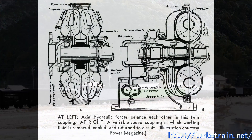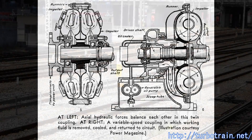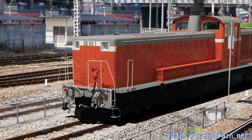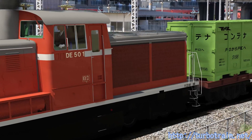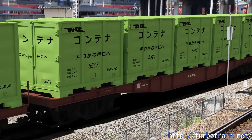Fluid couplings are simple and lightweight in structure, and can be turned on and off as well as adjusted for braking force by moving oil in and out of the converter. The oil cooling system for hydraulic converters can be used, and since it is compact and lightweight, it can be installed according to the required performance without much concern for weight. Brakes with fluid couplings have long been used in heavy-duty trucks, and there was little concern about the adoption of a new technology. DW7 is equipped with a fluid coupling that has an absorption capacity of 1440 horsepower, which is equivalent to the driving wheel output of the locomotive.